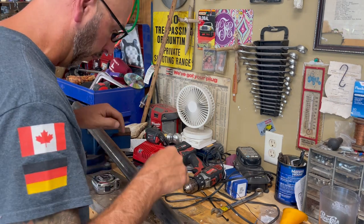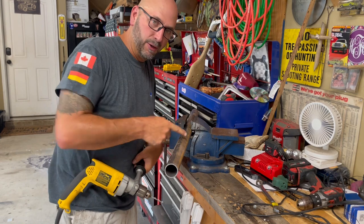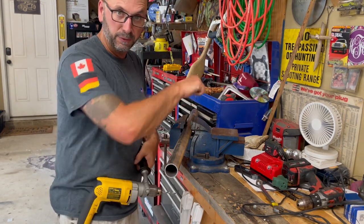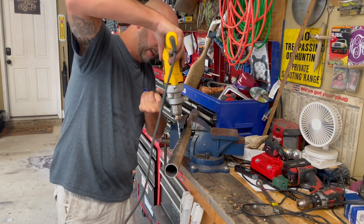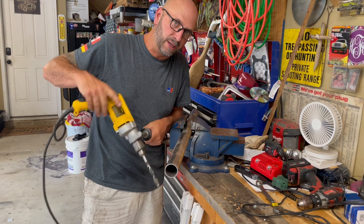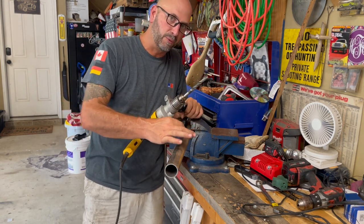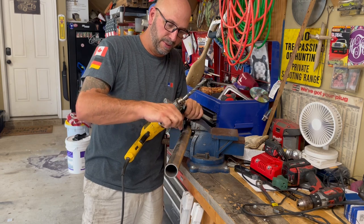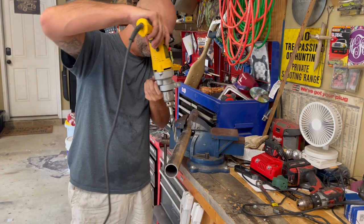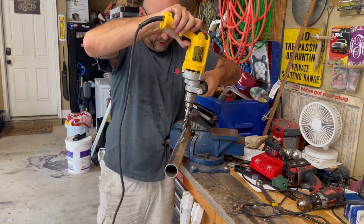The thought process is leave it whole — it's a little easier to drill and you don't have a little piece flopping all around. So we'll drill this thing out real quick. I'm going to weld the three-eighths nut on here, but I'm going to drill a half-inch hole so that if our nut is slightly off when we weld it, we don't have to worry about getting the thread to align. Just going with a big bit, real slow and carefully.